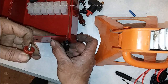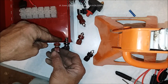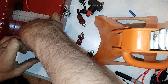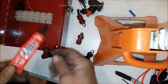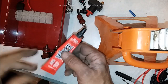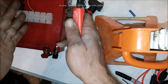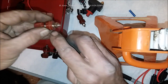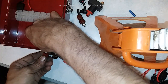I'm going to take the isolator, turn it inward, and mount it so it comes through the other side — it passes through about 1.94 millimeters. Then this piece goes on it. Now, the majority of the time I use weld glue when I put this on. I've been using this for about 10 years — it's a contact adhesive, non-electrolytic, and works great between metals and plastics. This is thermal plastic so it works great. Normally I'll put the weld glue right where this joint is going to be, and also underneath the first nut where it touches.